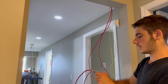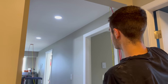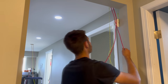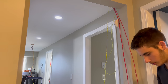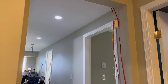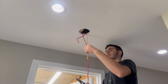Okay, I'm gonna detach this here. That we will pull until it stops, which is right there, and the zone we will pull until we leave just enough there for our box, which is probably about that much. All right, so I'll put our box in here, or slim box, pan box, pancake box. This is the SLC going over there. So we'll cut that back.